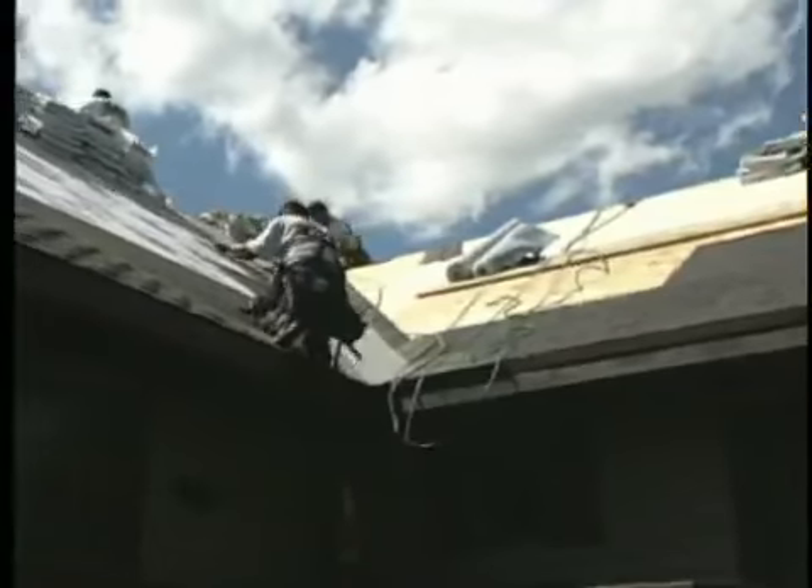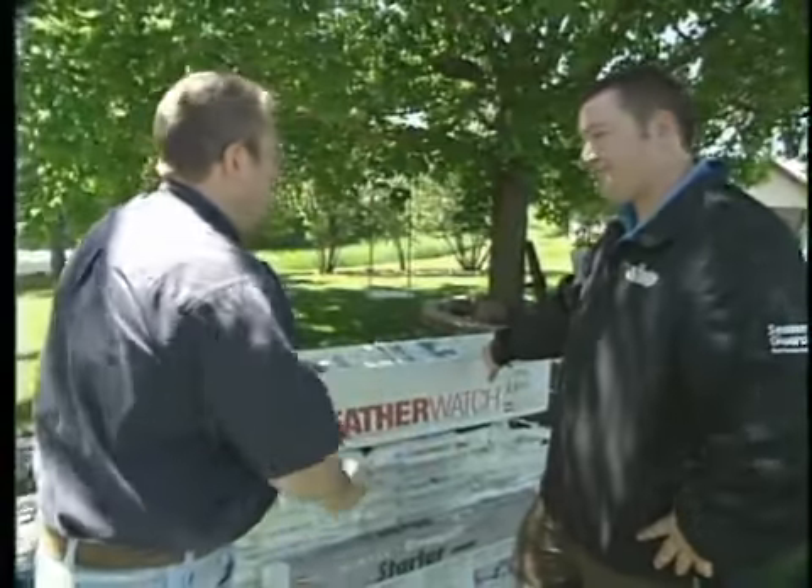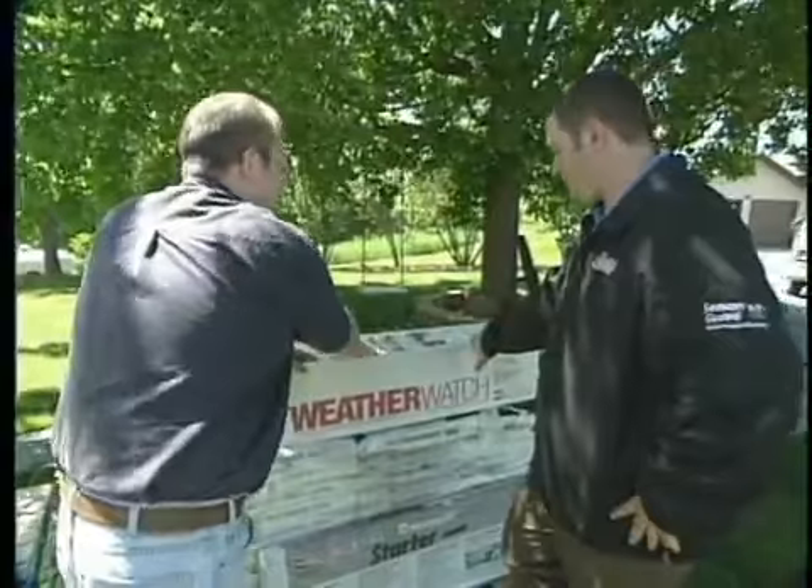Valleys are one of those spots that always tend to leak on a person's house. You've got your perforations in your roof, your sidewall flashing, and your valley areas. If you can go a little bit extra in those areas to ensure that for 50 years you're never going to have to worry about that roof — for a little bit extra money, it's well worth it. And that's an area where the consumer can request adequate leak barrier product on their roof.